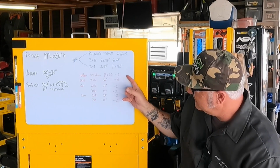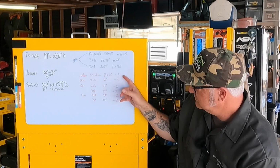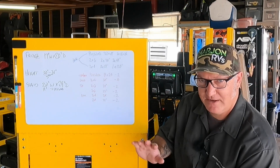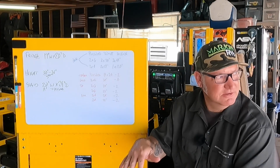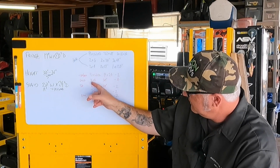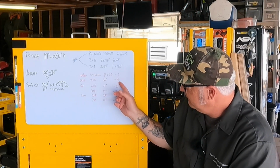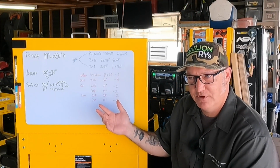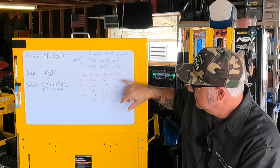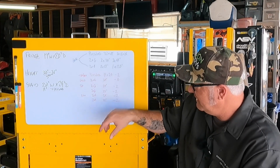And then this is what we need. For the top and the bottom shelf, we need two pieces of plywood at 19 by 24. Well, that one right there will take care of that, no problem. We might do a shelf in the middle somehow, but I'll figure that out at a later time. Legs: 2x4 legs at 30 inches height, we need 4. Well, 30 times 4 is 120. So we're good.